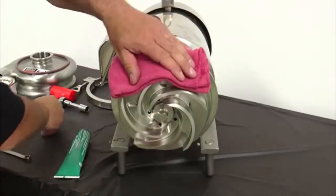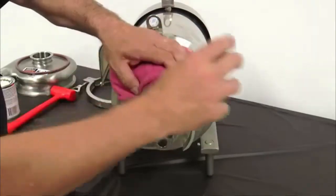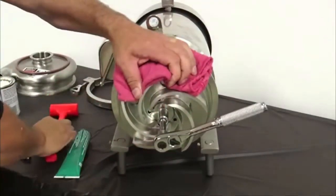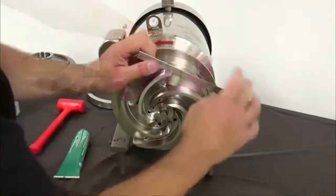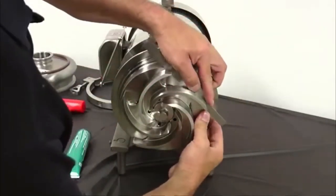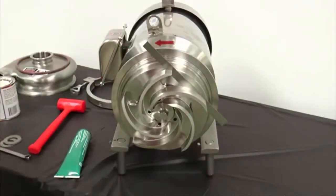Place a clean soft towel onto the impeller to hold it in place. Tighten the retaining bolt with a socket and finish by tapping the ratchet handle firmly with a soft hammer. Check the space between the back of the impeller and the back plate with a feeler gauge — 30 thousandths inch nominal — while holding the back plate tight against the bearing housing flange.